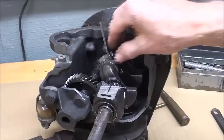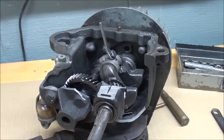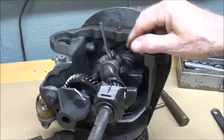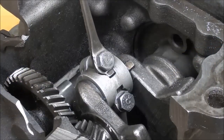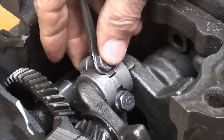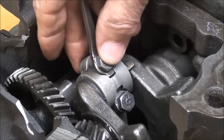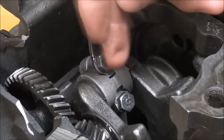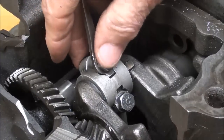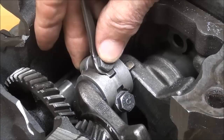The first thing I'm going to do is take off the two rod cap bolts here — that'll take the oil dipper off too. Inspecting this engine just visually with my fingers, there's just an awful lot of slop, way more than there should be. So I know this is worn, and I'll probably need one of the Plastigage sizes for greater clearance.